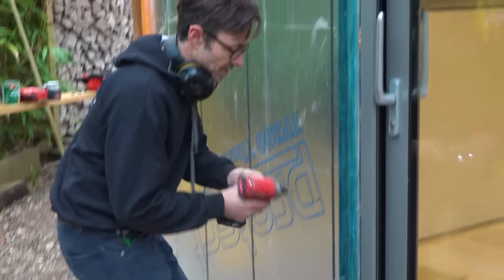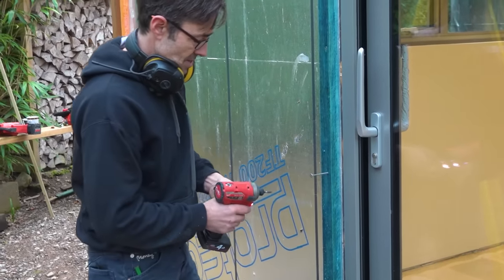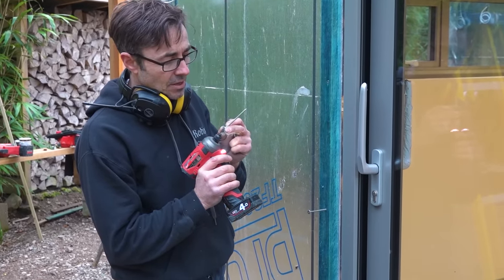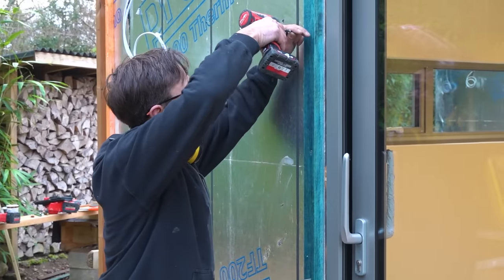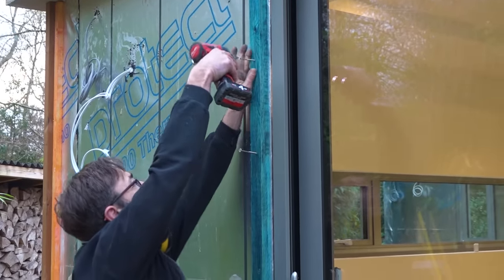These screws are designed just for battening. 77 millimeters long. It's the absolute perfect length. And they've got a really interesting head, which is dead flat with a slight countersink. So it doesn't push the batten apart without a countersink. And obviously Wirox. So it's good for moisture.